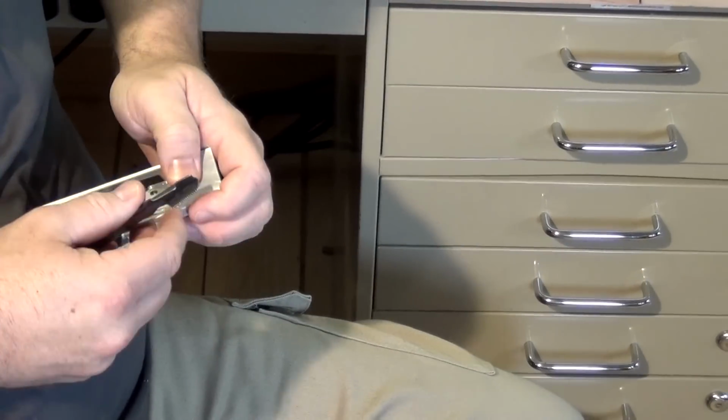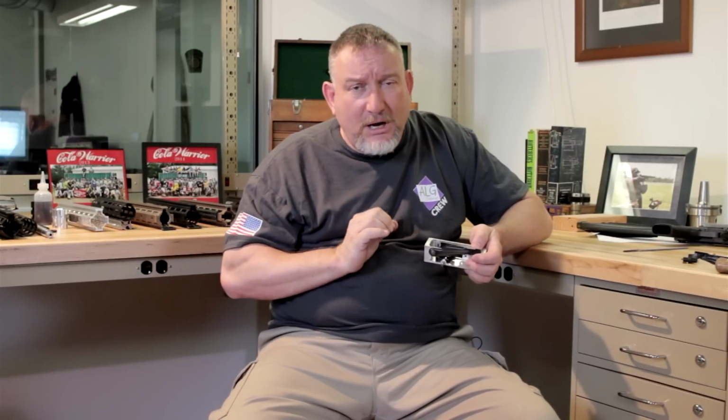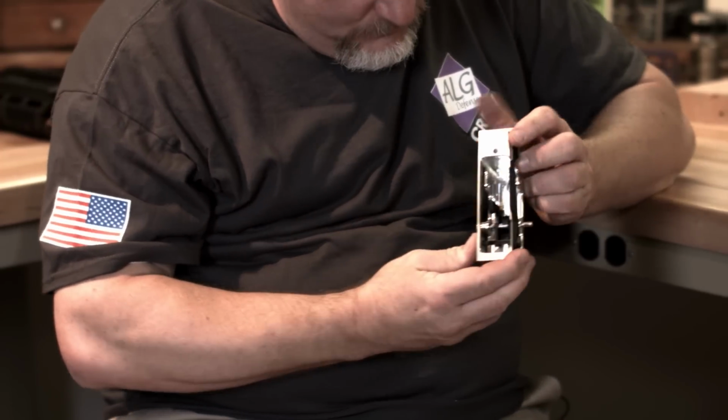Once you get below 45 Rockwell, a spring will easily start to take a set. So a spring, such as an automotive spring or a leaf spring or a coil spring, not necessarily coil springs that are in your gun, but when it's heat treated, that's the range you shoot for, 45 to 50.